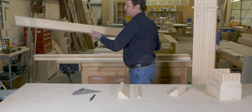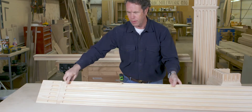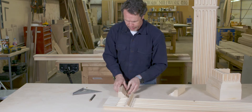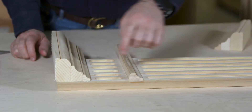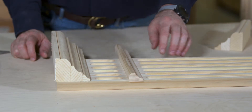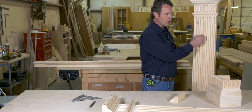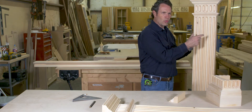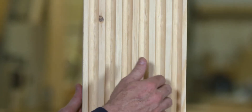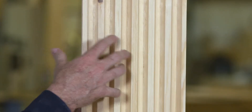The way we make our shaft is we cut our fluting into the shaft and we stop our fluting. This is where the neck and astragal fit in — right there — and then our capital fits right at the top. I've seen it where they run the flute right through the middle, and that just doesn't look as good. It looks better when it stops. Remember that there's a proportional relationship between the size of the flute and the shoulder in between, and if it gets too wide, it looks like you ran out of money and time. There should be a proportional number of flutes and a correct width of the shoulder to make this column look right.